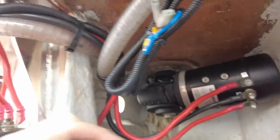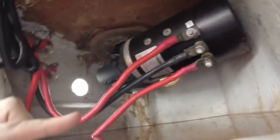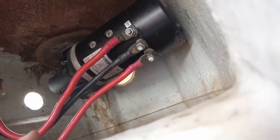Right, so this is the windlass motor. You can see the seal is dripping. That's why we've got water in there. I think I might get a rag and drain that out first. So there's two here. You can see the opening, it's like a little glass thing at the back. Well, it's plastic actually. I think that'll pop out. There's some silicone on it, and then there's a hole behind that. It's tough to access, but I need to get that off to reseal it and then fill the gel coat in that's underneath as well. So let's give it a shot.